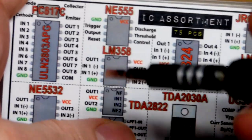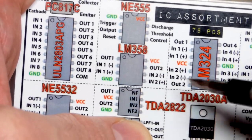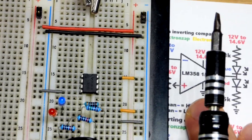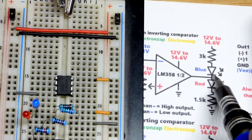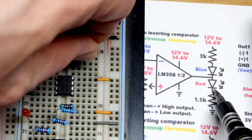If you buy one of these kits you will get the pin layout for it. We've got output, minus, plus on this side; same over here except the power supply pins are on the opposite side — shifted down one spot — but otherwise the pin layout is the same. That's how we power the integrated circuit. We're working with up to about 15 volts here. I've got a blue LED and a red LED.